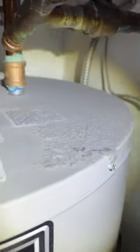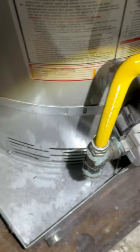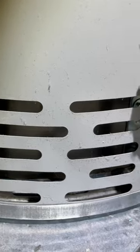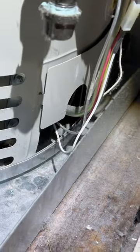This is probably one of the most overlooked home maintenance tasks homeowners forget to do, and that's cleaning around their water heater. As you can see, there is dust and lint collecting around this one, and it can be very dangerous and problematic. If you look behind that grated panel, there is a burner back there, and if enough lint and dust collect, a possibility of fire could occur.